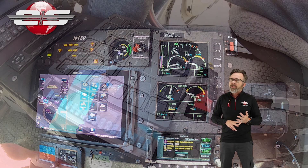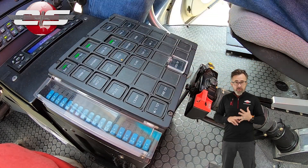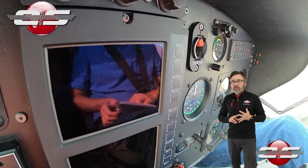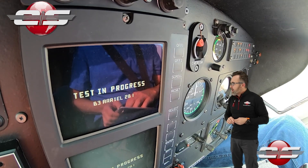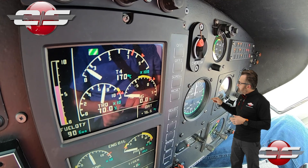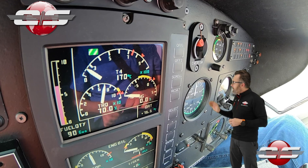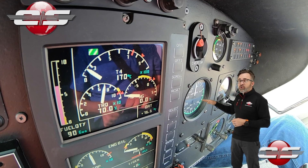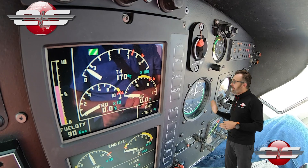When we're looking at the AS350-B2B1 and the EC130-B4, this test occurs right after you engage your power. So you need to look at your VEMD, you push your power, the test in progress comes up, and then you'll notice that your torque gauge goes to 70%. No other number, and then back down.